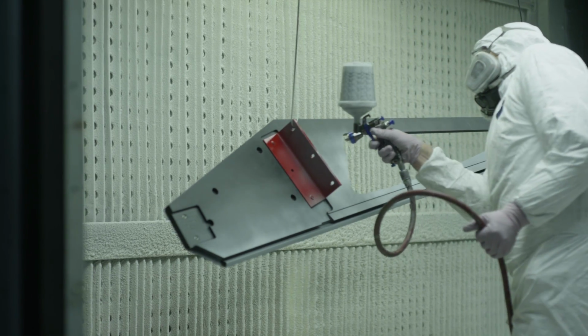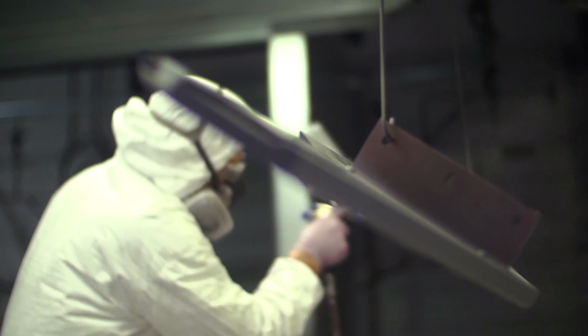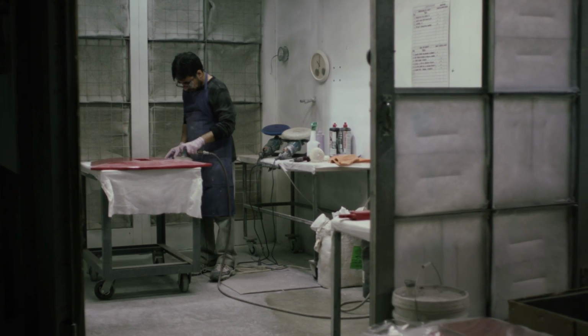The Neolith is made from a phenolic board. It's prepped with 600 paper. After that, we apply a coat of adhesion promoter. When that flashes off, we then apply multiple coats of a high build primer. That then is sanded with 600 paper again after it's cured, and we apply a couple of coats of base color to the customer's specifications. That cures for about 4 days, then we sand it and buff it.